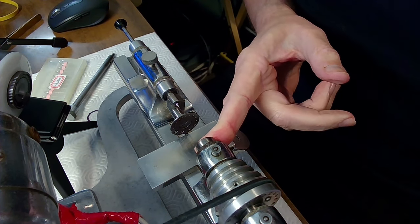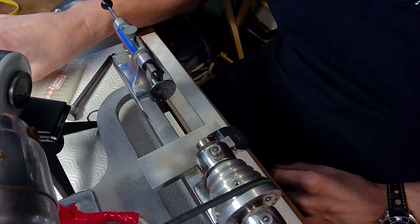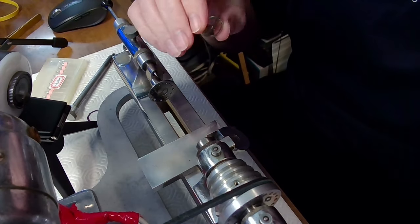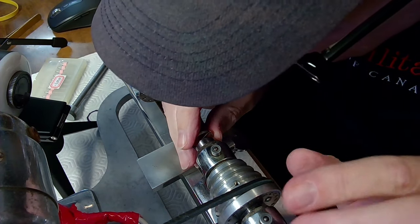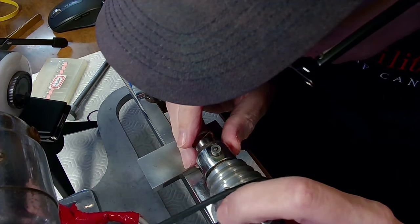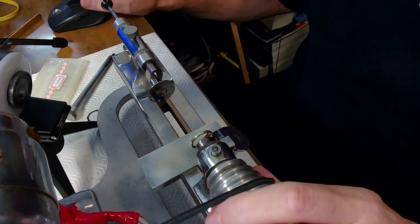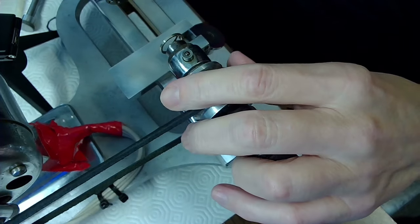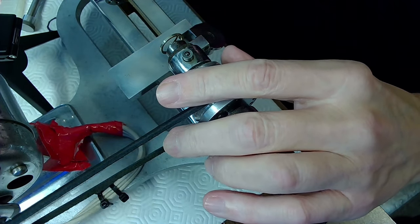I back this off to put the part in, and I have to be very careful not to screw up the pivot on the other side when inserting the part. That's the part that's going to be cut, so I tighten the collet — I usually hold the lathe with one hand while tightening with the other, so I can hold the part with my third hand. Someone said the other day you need more than two hands to be a watchmaker.